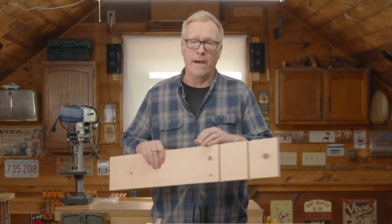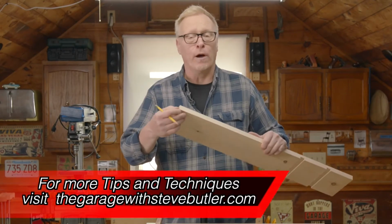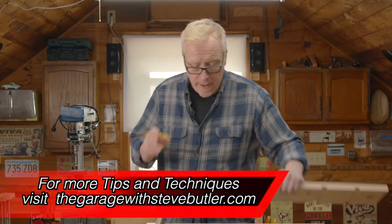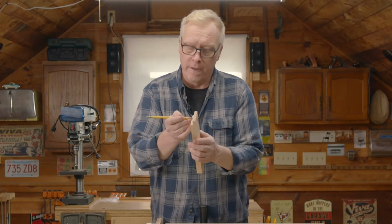Okay, now that we have our dados cut for our bottom and our fixed shelf, we need to cut a rabbet for the top. Now let me show you what I've done. I made a test piece. The rabbet is 3/4 inch long and it's 3/8 deep. So here I have cut on my test piece a rabbet, exactly that, 3/4 inch long, 3/8 deep.